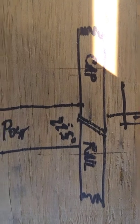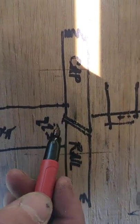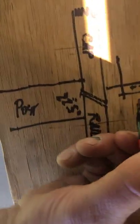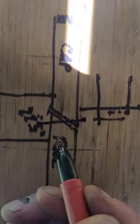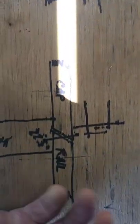That's pretty industry standard. Most carpenters will tell you that if they have to splice trim or anything like that, they're doing 22.5 on their saw. That's pretty standard. And like I said, the reason for it is when you run a fastener through here, you're actually catching a fair bit of meat on both sides of that splice versus just catching the very tip of a 45, if that makes sense.